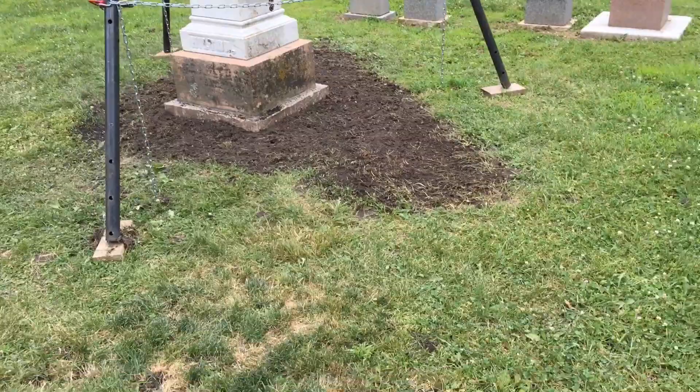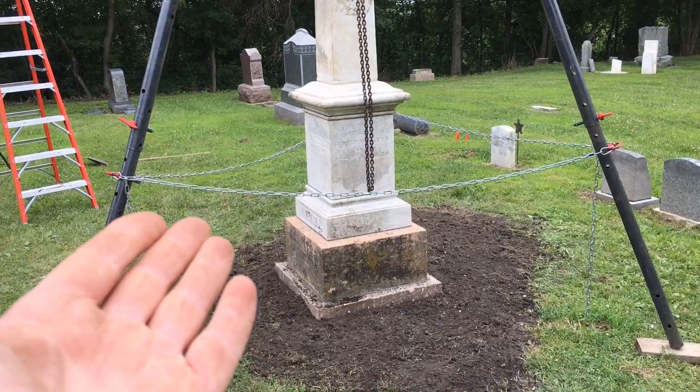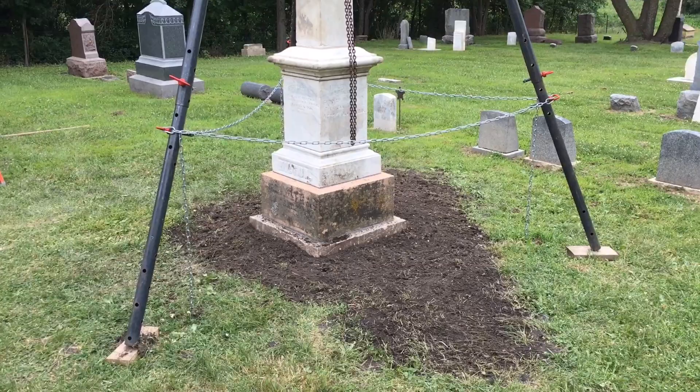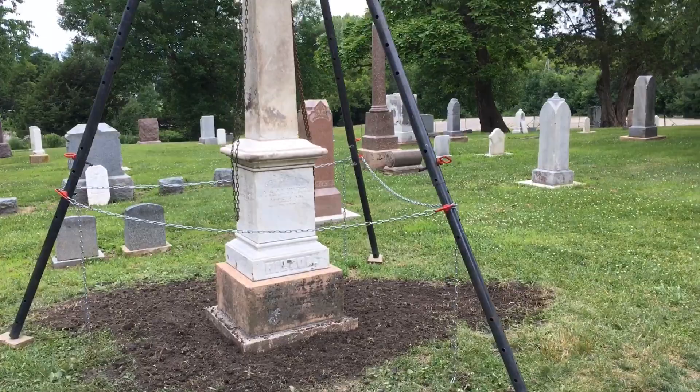The key thing here is the safety chains. Not only do they keep the legs from splaying apart — and I've got them up higher because when some of these pieces were on the ground, I needed the chains to be above them so I didn't mar them — but the safety chains also ensure that when I walk the tripod and move it into different positions, the legs are basically evenly distributed so the center of gravity stays as close as possible to the center of gravity. That way it doesn't shift and I don't get top heavy.